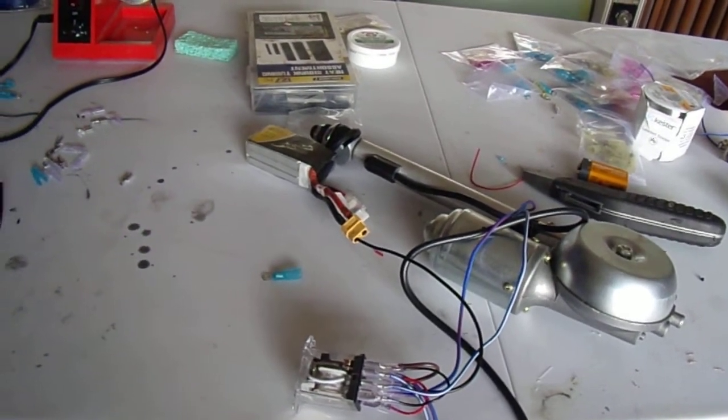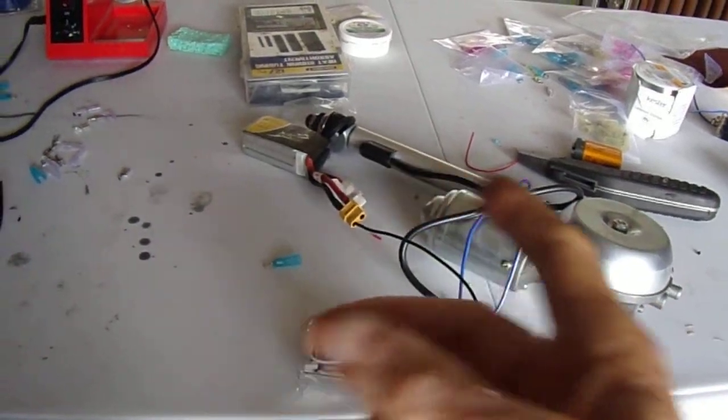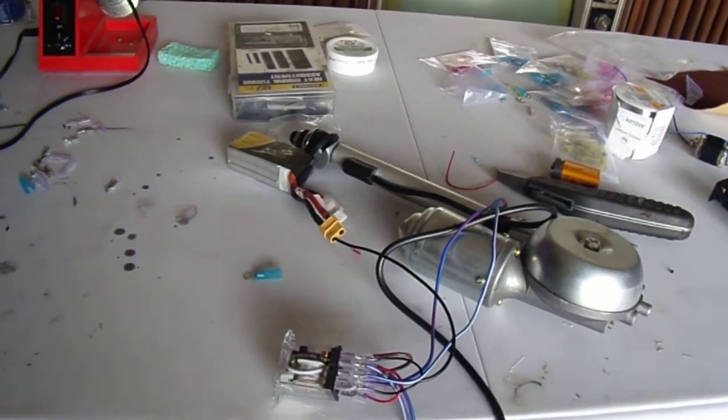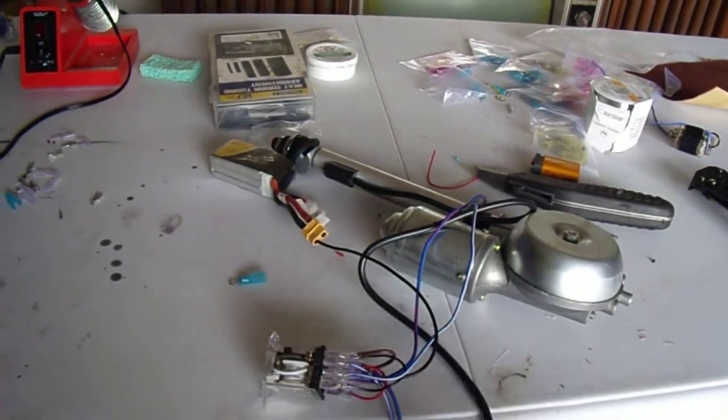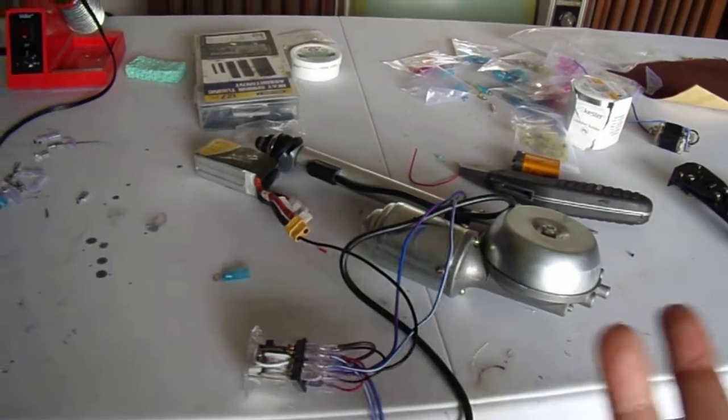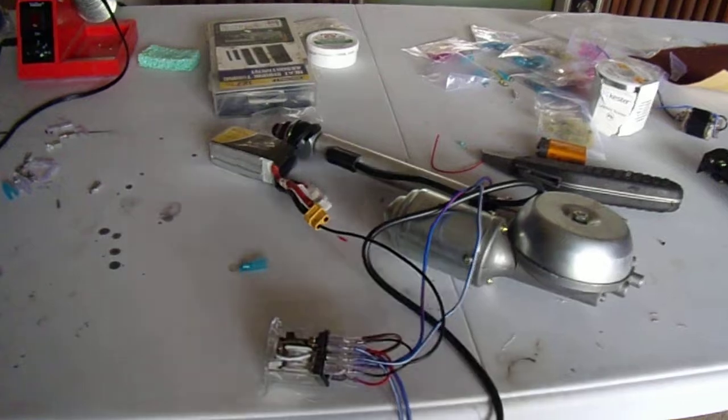It's no drag whatsoever. When I disassembled the original antenna, there was all kinds of gunk that gets in the mast and just kind of cruds up, and I think it makes it harder to drive. It's probably why I ended up breaking the rope. When I installed a new rope it would break, probably because it's just working too hard. But that's all for now.